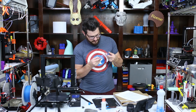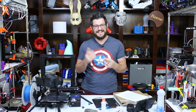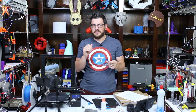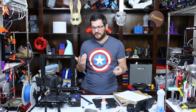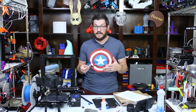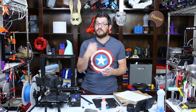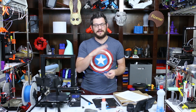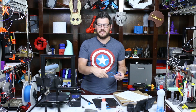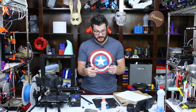On the bottom surface everything looks perfect. Bed leveling was really good and you get a really nice shiny mirror finish on this — a nice thing about having a PEX or PEI sheet. It gives you that beautifully glass-smooth layer. You get the same thing with glass, but PEI grips a little more to other materials than glass will. I still prefer to print on glass, but this really does make it a lot easier and you can print many more materials. For flexibles, just put a layer of glue stick, Magic Goo, or a similar interface layer between the PEI and the flexible material, and it holds great and releases easily with a flexible build plate.